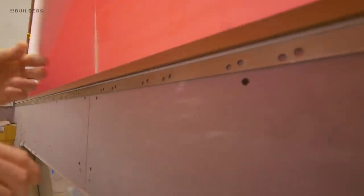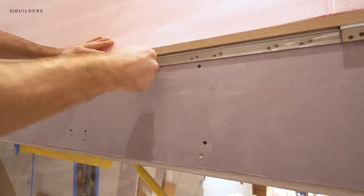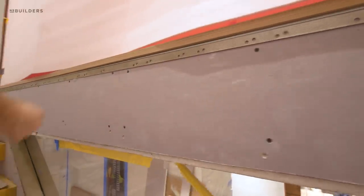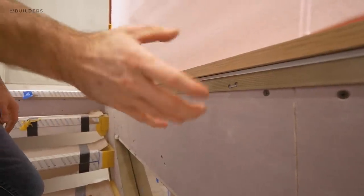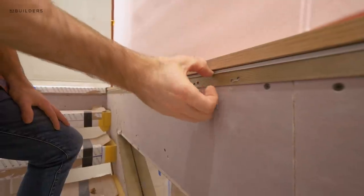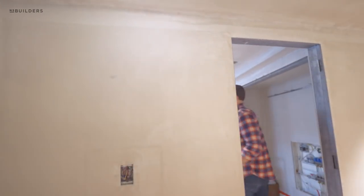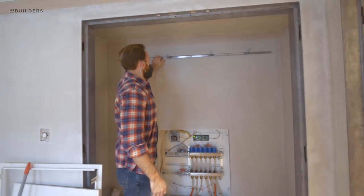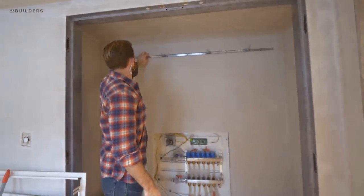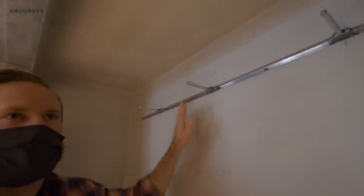Glass comes down and hits our oak nosing, and we've used a quarter-inch reveal so that the plaster can come up and it'll all be white plaster — a really intentional shadow with the nosing on the same plane. Creating these intentional shadows is what makes everything being coplanar work — there's this intentional stopping point from plaster to oak rather than running plaster tight and making it a caulk joint. James has been on site prepping closets with floating shelves recessed back into the plaster, giving him adjustability to make sure they get installed correctly.